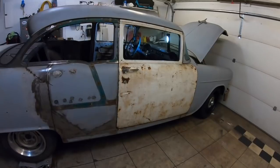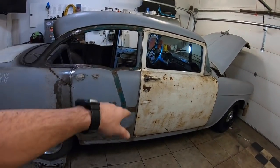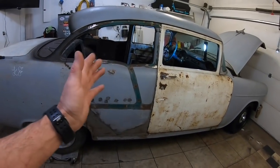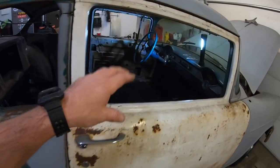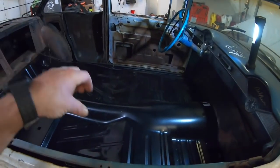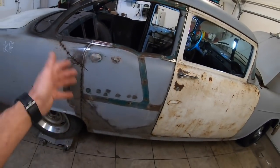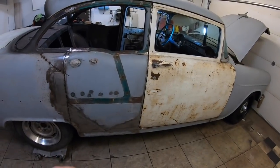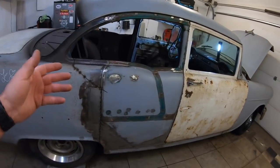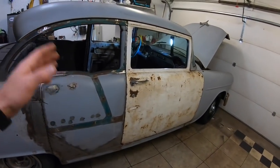If you're not taking the body off the frame, when you go to move your post and all that to do the conversion, go ahead and think first. If you're planning on doing the floor, go ahead and get it in the car when you blow out this side. Then you don't have to cut it out the way I did after I'd already built everything.